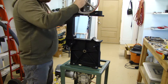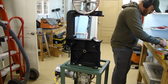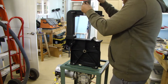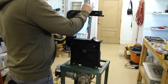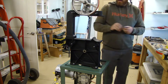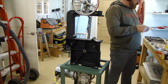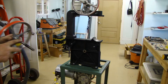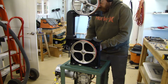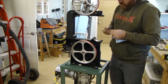And now just reassembly. I got the tires for the bandsaw on Amazon and they were a tiny bit wide, so I had to cut them with a utility knife — but they're urethane, orange urethane tires for the bandsaw wheels. Here putting that tracking and tensioning mechanism back together. And then here's the lower one — what you see me spray just a second ago was white lithium grease.